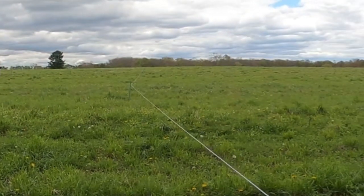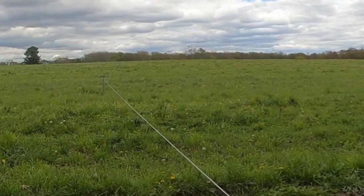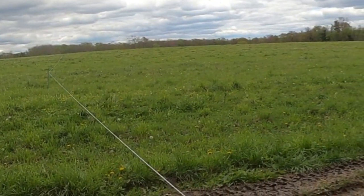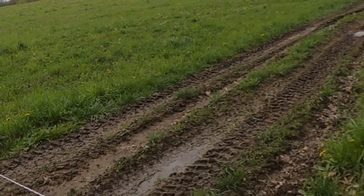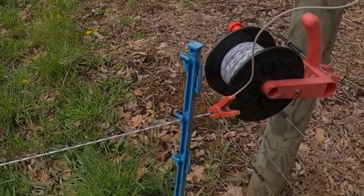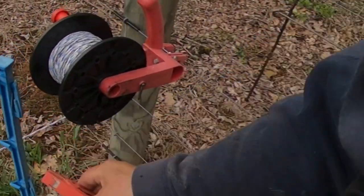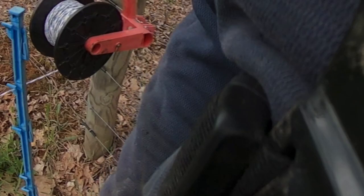As you can see, the fence is not straight at all — it's hot and off the ground, that's all that matters. Another factor that will require putting posts closer together is if you have a lot of snow and ice, because snow and ice is going to push that wire toward the ground.